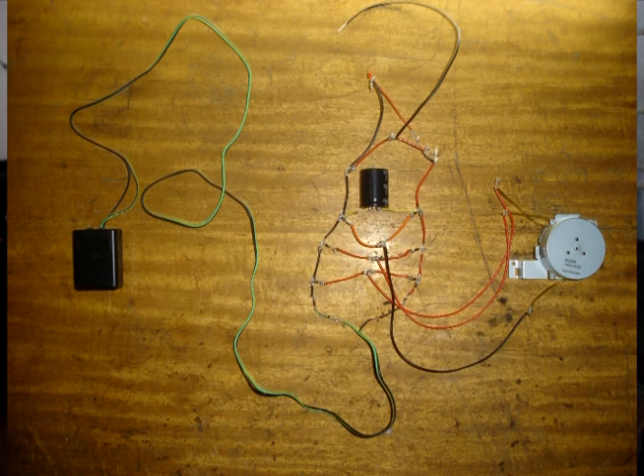I'm going to use the battery pack and wire the motor into our rectification circuit. The capacitor is used to hold the charge that's generated by the motor, and then the capacitor slowly discharges either into the load at this end — which is the LED and the resistor — and also feeds the battery pack as well and charges these batteries.